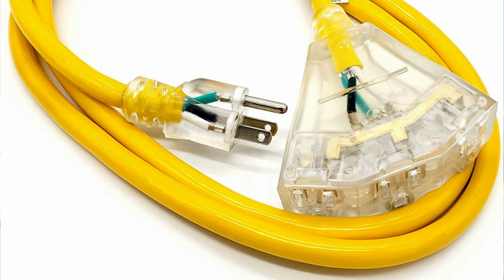If your boat doesn't have shore power connection, well, it's really simple. All you have to do is get an extension cord, the ones that have one end maybe 4 connections, and on the other end just one male connection. And the male connection you connect to the generator, and then you just run the wire inside to your cabin so you can hook up various appliances or whatever you need to hook up in there.